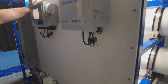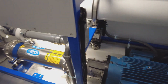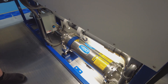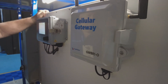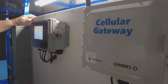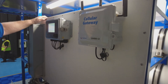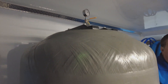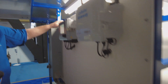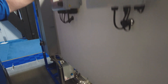We should also mention that over 90% of the water is saved — we run less than 10% loss. When this unit starts up on dirty water at around 5,000 TDS, it runs at 150 to 160 gallons per minute at 450 to 500 pounds of pressure. Within the first hour, the gallonage goes up about 10 to 15 percent. You start off wasting around 12 to 13 gallons a minute, then drop to about 8 gallons a minute. In the last hour, you run as low as 5 to 2 gallons a minute of waste.